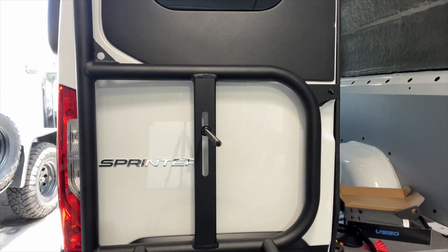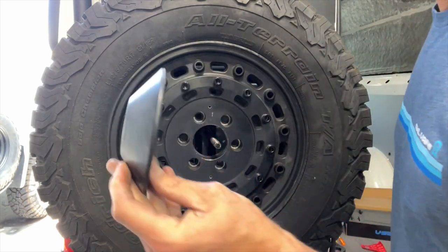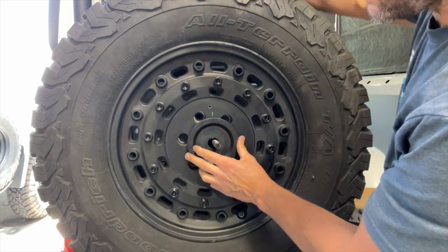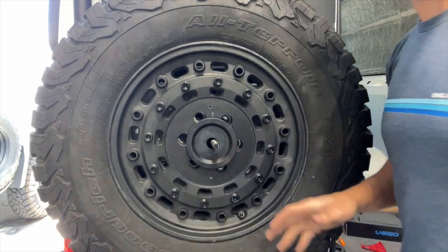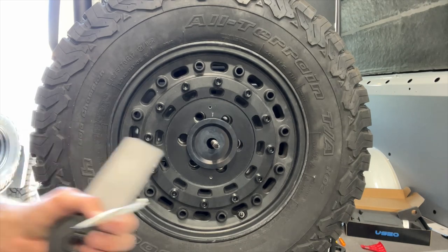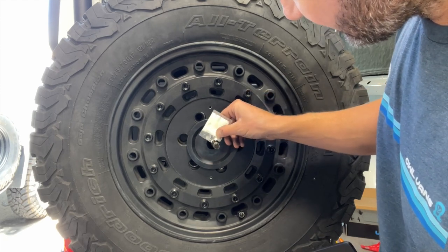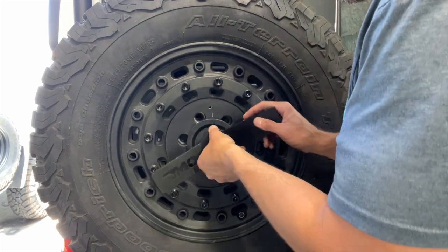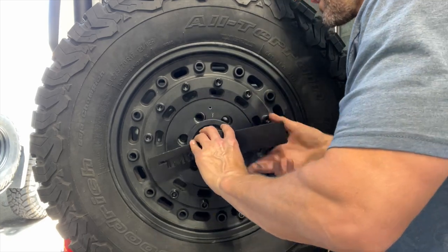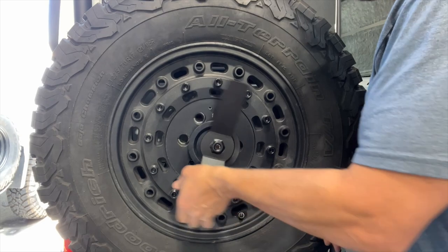The wing nut on the end is going to hold everything together — all this bolt is doing is holding the all-thread from sagging. Put the wheel and tire back on. When it comes to the cone washer, the cone goes into the tire — and you'd be surprised how often people don't know that. You can put a little anti-seize on the threads if you have it — even though the stuff is stainless and coated so it won't gall, it makes it a little easier to get the handle on. A little anti-seize goes a long way. Now it's just a matter of screwing the handle on.